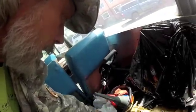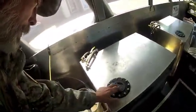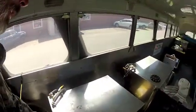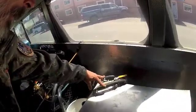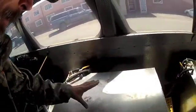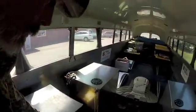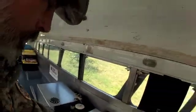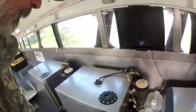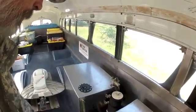Keep the tubes in the pump so we don't lose any or make a mess. And cheesecloth and our fillers put it into the tanks here. Then of course it goes into these two tanks. We fill, then we heat it with our engine coolant, which runs through here, goes through the oil and heats it up with our engine temperature. Once we're at 180 degrees, we can turn it on, and it feeds the engine from that filter into the valves underneath the floor here.